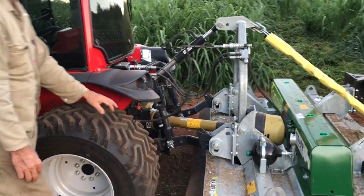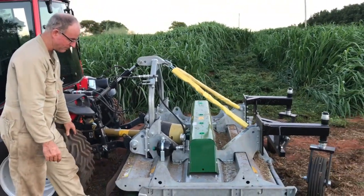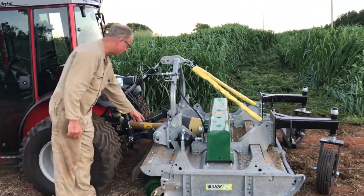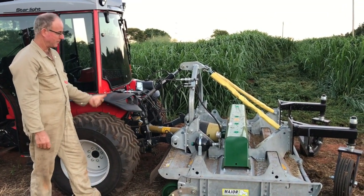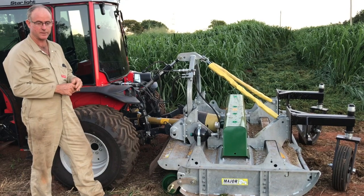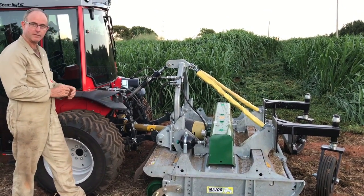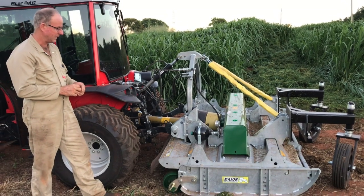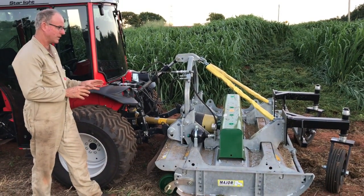And if it were a mulcher and it didn't have wheels out the front, all it would have was this back roller. All you need is the lower link load share system, which comes from Carraro, BM, AGT, Reform, AB. All those companies generally offer that feature, some of them as standard, some of them as optional, and that's all you need for a mulcher.